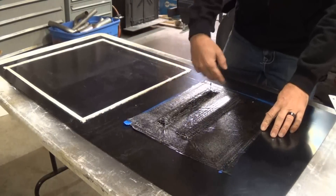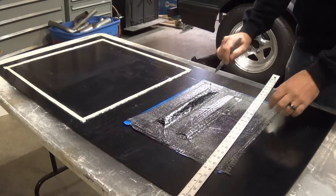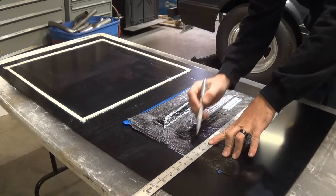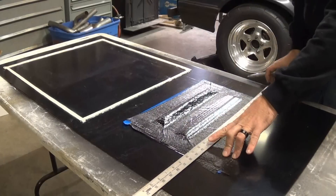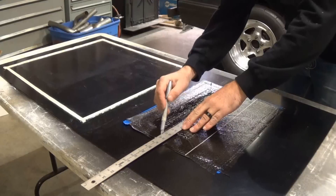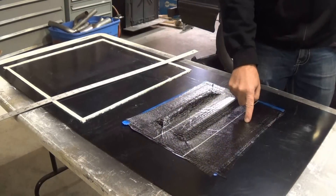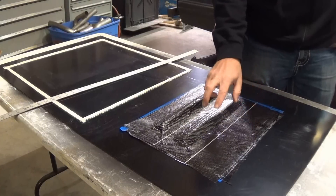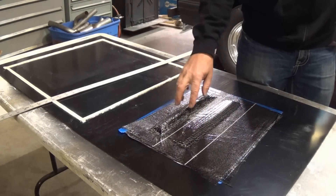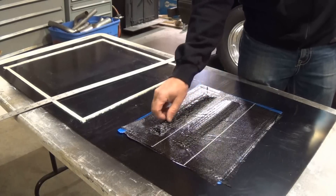So what I'm going to do now is split this thing into three pieces. Four layers — two on top, two on the bottom. Just going to cut it. Just like that. Four layers carbon fiber, two layers on the bottom, two layers on top, just with some foam in the middle. And then the same thing here with a piece of thick foam that I've cut into a triangle piece.